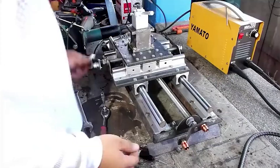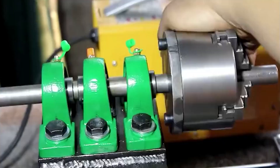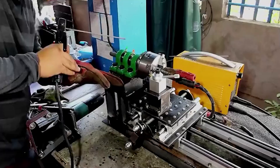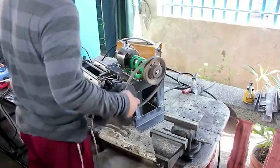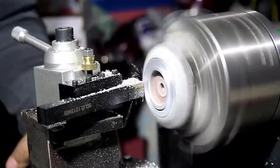Next up is a mini lathe from SEC Austria. The lathe is one of many homemade tools and machines built by the prolific toolmaker. Made from steel stock, off-the-shelf components and recycled parts, the bed and ways were fabricated from angle iron and steel plates. To keep the lathe accurate, SEC adopted the popular linear rail and bearing block approach for the ways and the carriage. The machine is driven by a washing machine motor that SEC found in his stash. Uncomplicated to build, accurate and capable, this lathe has all the must-have qualities of a homemade lathe.